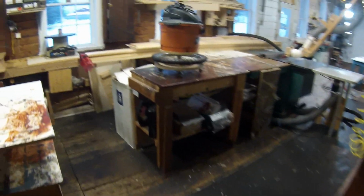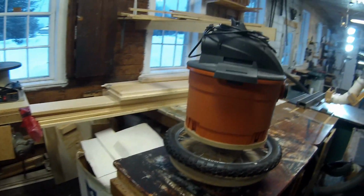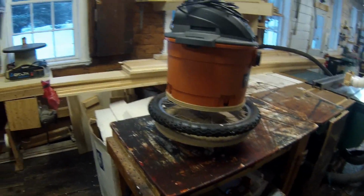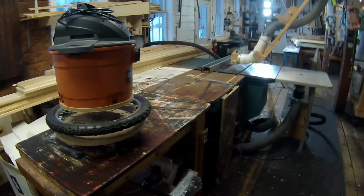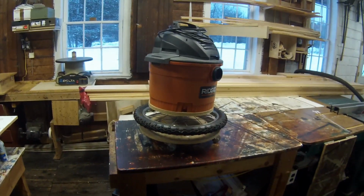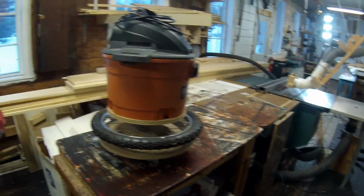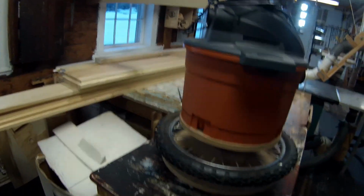And I wasn't realizing it until I had this interaction with the fridge and the papers, because then I could see the papers flying off. You can't really see the fine dust that kicks up. Unless it's like first thing in the morning when the light is really low, it comes in, you can see dust particles in the air. But at any other given time of the day, you're not going to see dust kicking up. Okay? So shop vacs suck up a lot of dust, but they kick up a lot of dust because this air current in back of it is so strong.